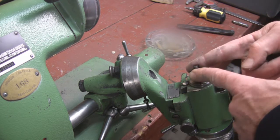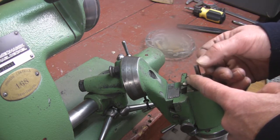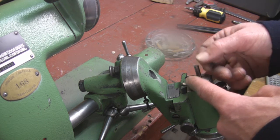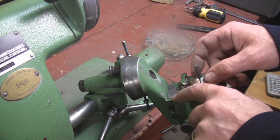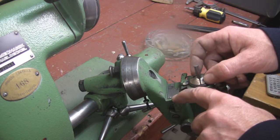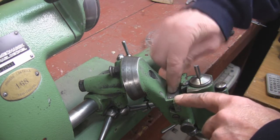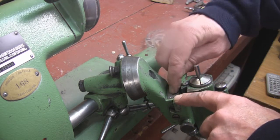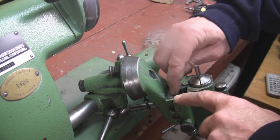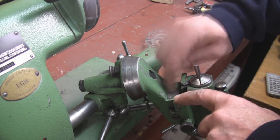What I'm going to do is grind a quarter inch cutter with a 60 thousandths radius on the corner. The very simple formula: half the cutter diameter, which is in this case 125, minus the radius 060 is 065. So I had to set this vernier at 065, and I'm going to do a whole section on how to set the vernier. It's not that hard. If you're familiar with verniers, it's very easy, but for you guys that are maybe more digitally inclined, a little bit to learn there, okay?